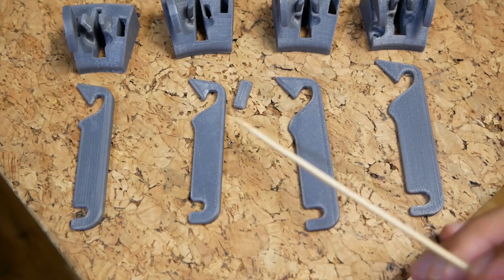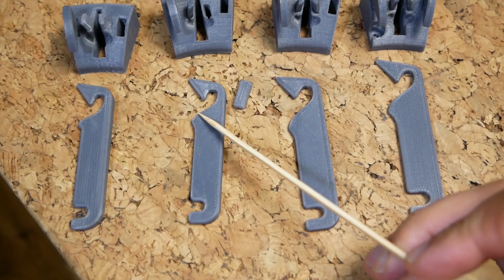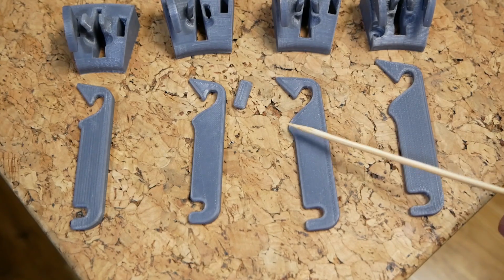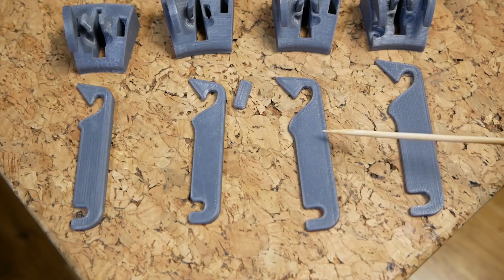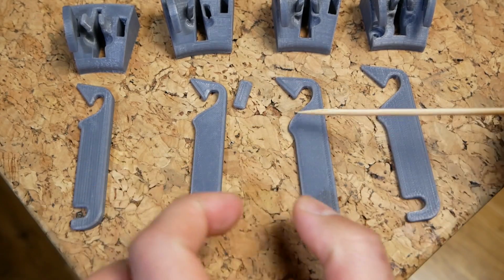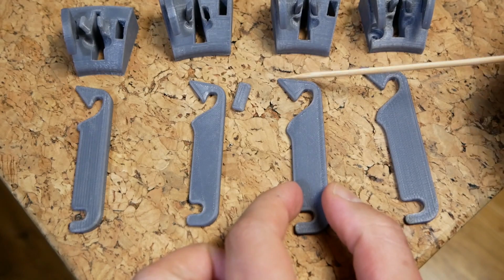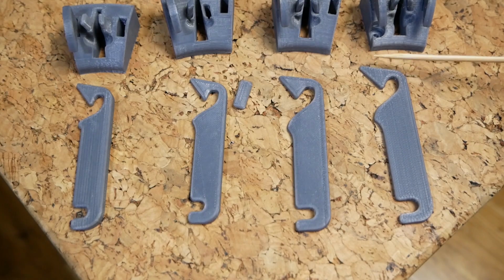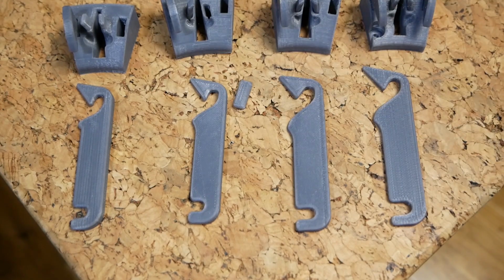And then I ended up having to change that again because the line would get stuck here on the stage 2, on the upward stroke. So that's changed a bit, and then that kind of worked, and I had to make it a little bit longer from here to here, and then it went longer still from here to here. But then when I made this fatter as well, that dimension increased from this one to this one. This slope here was no longer acceptable for stage 3. So I had to make this whole thing longer again, and that angle now resembles more what it used to be. This kicker again has been a little bit improved, and the rail follower here on the bottom is enlarged.